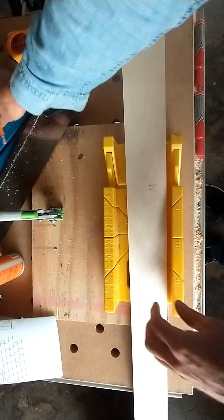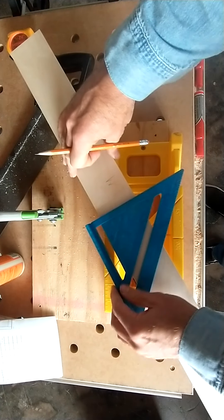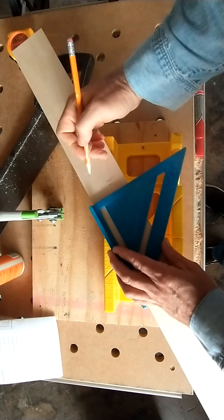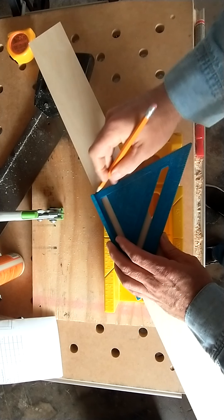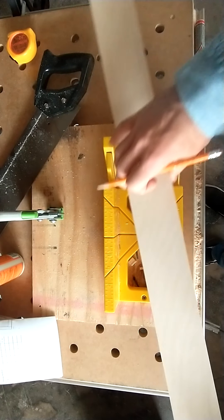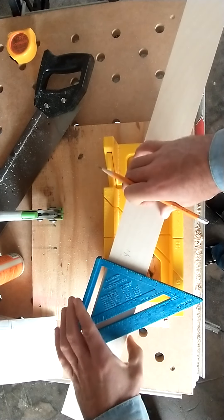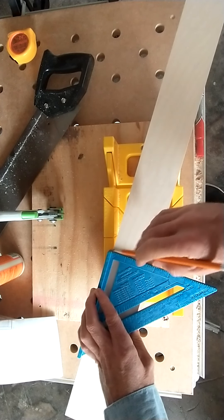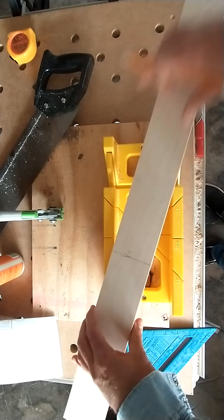Now I'm going to lay my tape here and get my speed square. The first step is always to make the lip tight to an edge, then slide it through my crow's foot and make my ninety-degree or square line. Go to my other crow's foot — first step, make it tight, now I'm sliding it. And there's my other line.